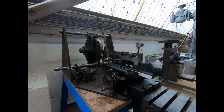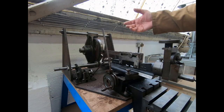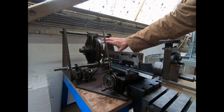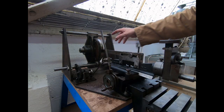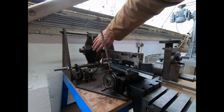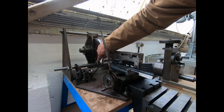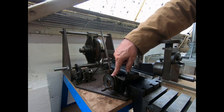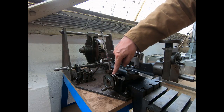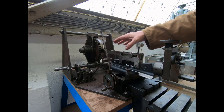This would be the indexing to make it feed across the table to allow you to cut across your workpiece. The gentleman who did the automation effectively put all this part at the back. It's a pretty simple logic — he's got one runner here, another one here. There's a shaft here with a key in it, and this two-toothed piece will slide along. As this is connected to what I assume is called the traversing mechanism, as it rotates it now drives — the back half is linked to the front half.